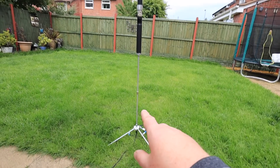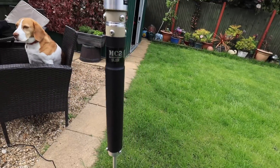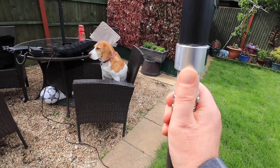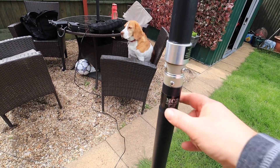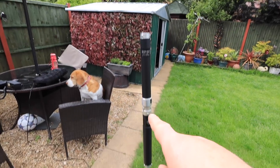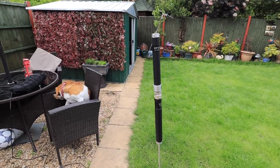I've got the radials on the bottom there. On the bottom bit is the VHF diplexer. This bit here is the coil for your HF. This is the VHF band diplexer. When you take out the whip or the telescopic, it can get a tune on 6 metres. So that currently is tuned perfectly at 50.150. So I've got a makeshift 6 metre band antenna there.